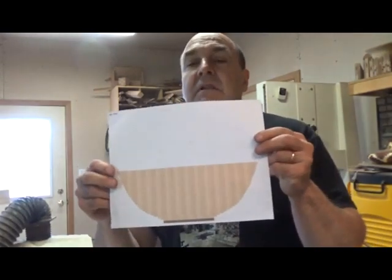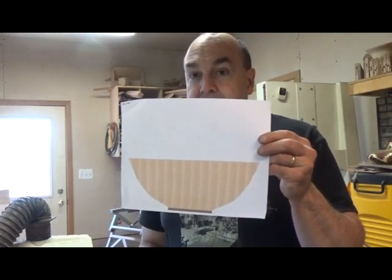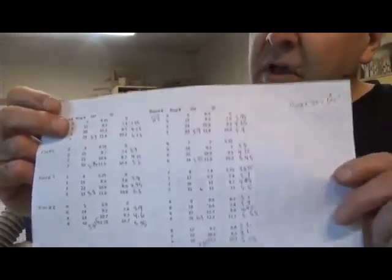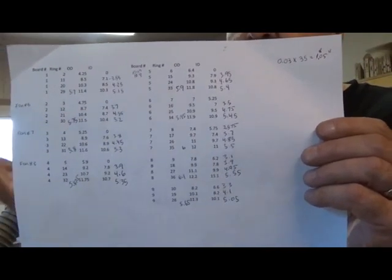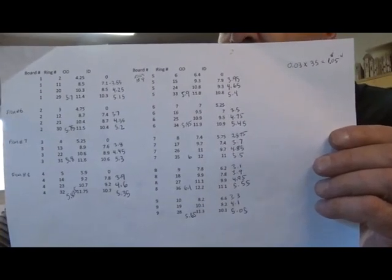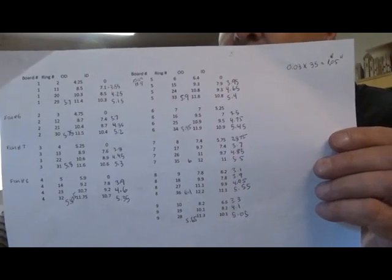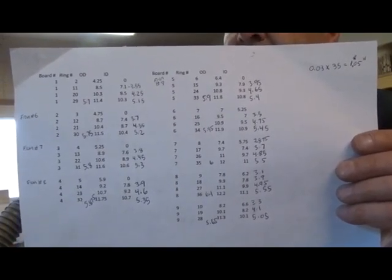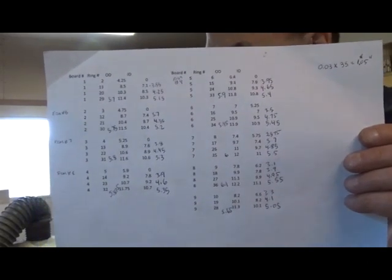This will give me the shape I want for the bowl — I'm going to go with a bowl-shaped bowl this time. There's a lot of wasted material. What I did here was made up a spreadsheet that for each board, what size rings I can get out of it. When I do a straight line using stack lamination, there's very little waste. With this, because the rings are expanding quickly at the bottom and hardly anything at the top, you need more boards to cut your rings out. So I've gone through and figured out the ring sizes.